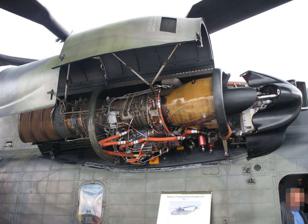Performance: Maximum power output – 4,330 hp. Overall pressure ratio – 14.9:1. Turbine inlet temperature – 1,180°F (GE-413), 1,325°F (GE-415). Specific fuel consumption – 0.48 lb/hp/h (0.292 kg/kWh). Power-to-weight ratio – 6.014 hp/lb (9.887 kW/kg).